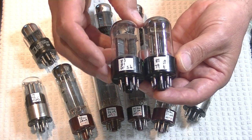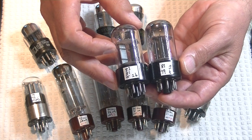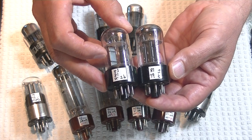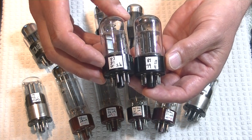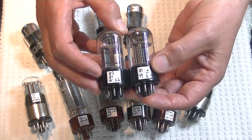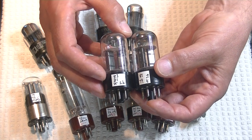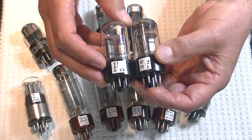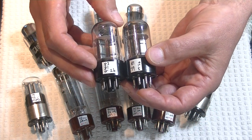What is really important, though, is our testing numbers. In this case, we want a twin triode — two tubes in one envelope, which is very common. One of the most common twin triodes is the 12AX7, a much smaller tube. 83 and 81 — that's just a hair over 2% variation. 81 and 79 — same thing. This is a matched pair. Anywhere 5% or less is considered perfect. But with older tubes from the 50s and 60s, anywhere inside a 10% variation is perfectly acceptable and you won't hear the difference in sound. You want to keep it inside of 10, though.